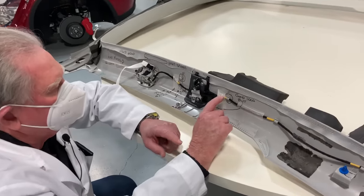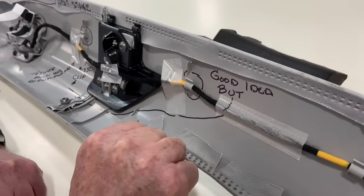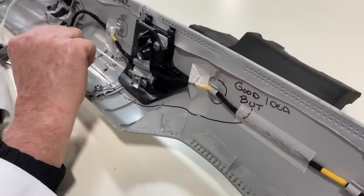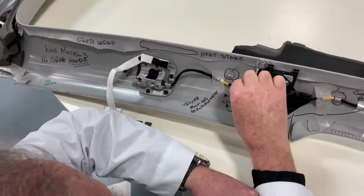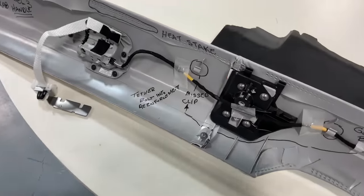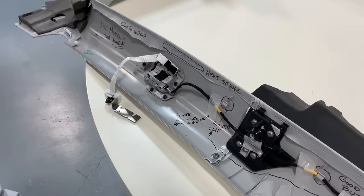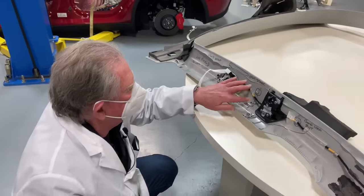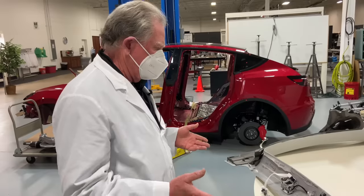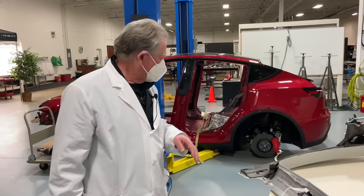Here's one of those little clips I was talking about — I can take the wire and slide it in and hold it in place. But look over here — what happened here? You can see the tape is still in place but this clip has been cut off. It was cut off, I think, when the harness was in place. That's a bit scary. Looking at the scuff marks here, it looks like a Dremel was used to cut this off. My guess is this part of the harness should have gone through here and held everything in place. It's on both sides — the other side is the same way. If I was Elon, I wouldn't be happy. People need to do everything consistently; it can't change.